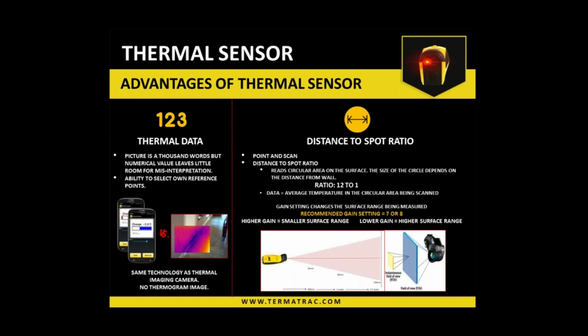Okay, so it does depend on the situation and what type of timber. So if you're trying to see, for example, again, if we use a timber window frame as such, you'd want to be closer, because you'd then be using a smaller spot size. About one or two feet gap distance? Oh, one foot, yeah, even. Yeah, only 300 millimeters, 12 inches or so. So then you're using a 1 inch spot. But now if you need to do a section of a wall, up to about 3 or 4 feet would be that sort of size.